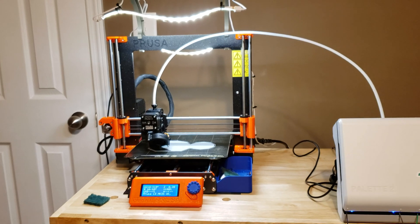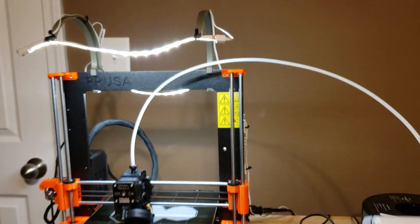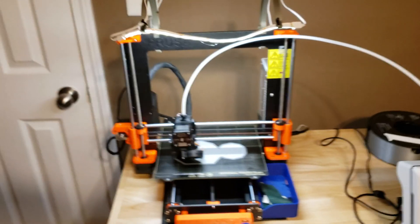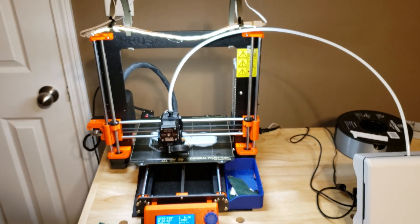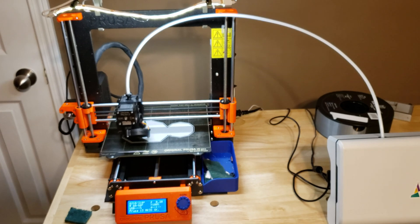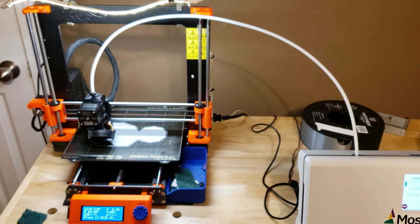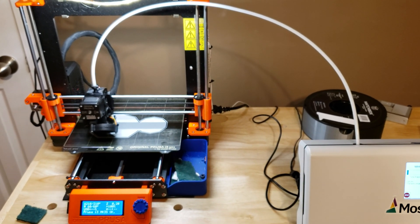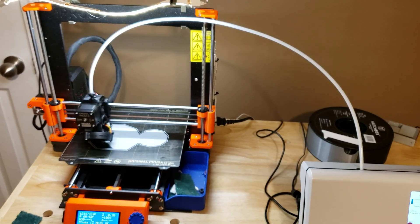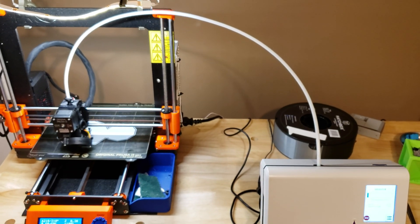From the printer's perspective — and again, my makerspace is a wreck because I just installed this day before yesterday, so I've still got the janky LED strips hanging up — as far as the Mark III is concerned, there is one continuous strand of filament coming to it. Infinitely fewer opportunities for prints to get messed up because you're not doing a tool change every layer. There's a purge block, which is customizable with the Palette too, but you're not doing cool downs and ramming and retracts and reloads during your wipe.